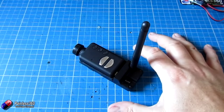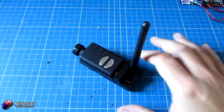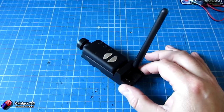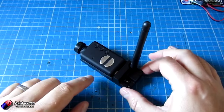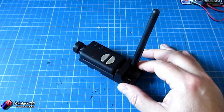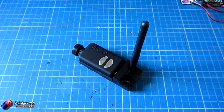In this video we'll look at what you get in the package and the other things you're probably going to need. We'll look at how you connect up to the Mobius and configure it so that you're recording 720p when FPV flying rather than 1080p, which will reduce the lag from the Mobius and make it a much more pleasant FPV experience. Then we'll look at a couple of safety bits and finally talk about my experience using this in practice. There are also lots of other videos on the channel about the Mobius — I'll link to them in the description.